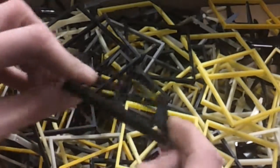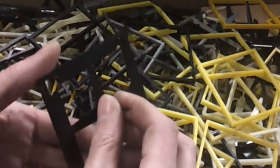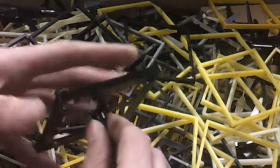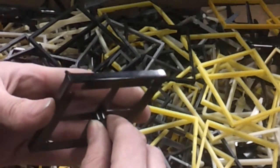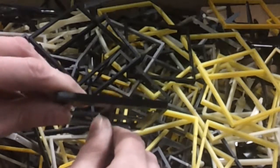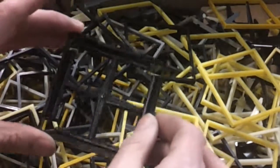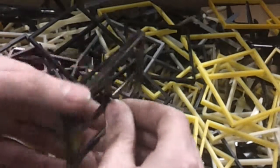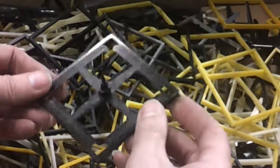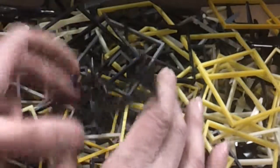Some of the edges were coming up clean, but because this is a cosmetic finished product I really need clean edges all the way around. In desperation I switched to nylon 6 and this has done a much better job. I think it still needs a little bit more tweaking and perhaps a bit of polish, but that edge is pretty shiny and clean. There's a little bit of flash at the corners which shows how much pressure I'm having to use — up to 40 tonnes of clamp force and 2200 bar on the injection side, which translates to about 13 tonnes of injection pressure. That's the only way I can get it to come up clean. I think the ABS is a non-starter for this sadly and we'll just have to make the rest of them out of nylon 6, but at least it does work.